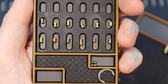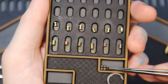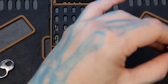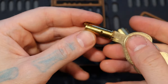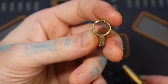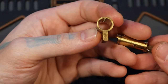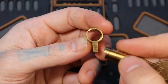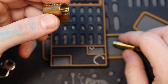I already have this gutted and you can see all along the top here we have spools from chamber 1, 2, 5, and the very lightly serrated in chamber 6. Down here are the ball bearings that were inside of our plug for our key control system. Here are the holes on the side of our plug that hold these ball bearings. When the key has the right hole on the side, the ball bearings sit flush with our plug, allowing it to rotate. If you look at our housing, you can see these curved spots where the ball bearings will be protruding into if you don't have the right notch of the key. So if any other key was in here, it would push these ball bearings out into these protrusions and wouldn't allow it to turn. But with the notch, it allows the ball bearings to go just into the plug just enough, allowing us to rotate the plug and getting it open.